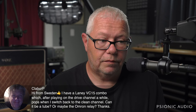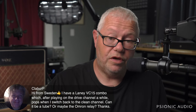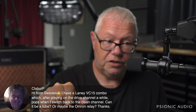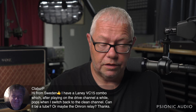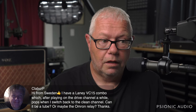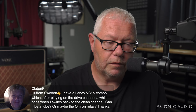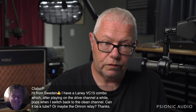But given the way you phrased your question, it seems like if you play on the drive channel a while and then you switch, it pops. Whereas if you just go to drive channel, then back to clean channel, then drive channel, then clean channel, it doesn't. That would make me think that it's a capacitor, which is building up and then discharging over time. So if I had that behavior, I would look at the electrolytic caps primarily in the low voltage supply first.